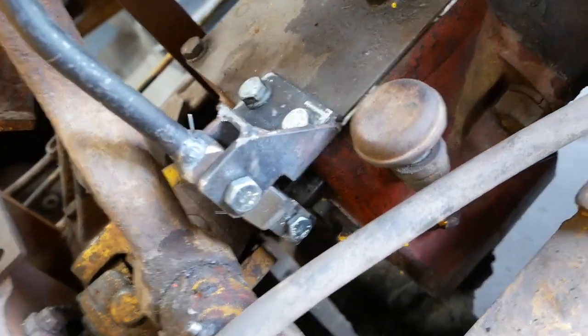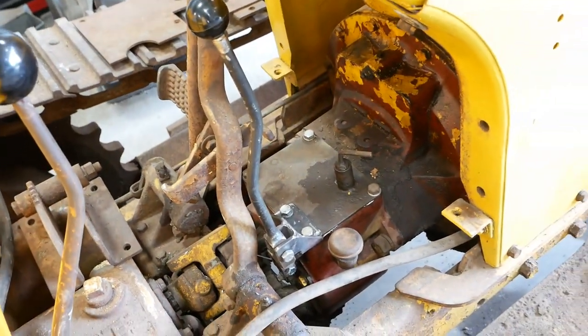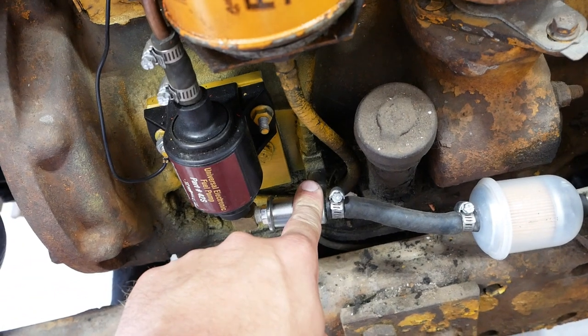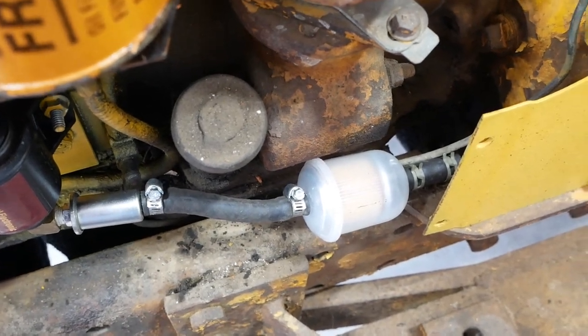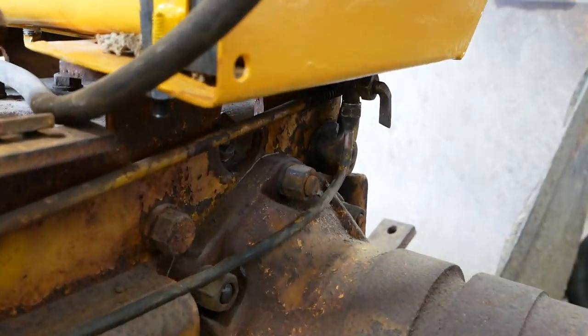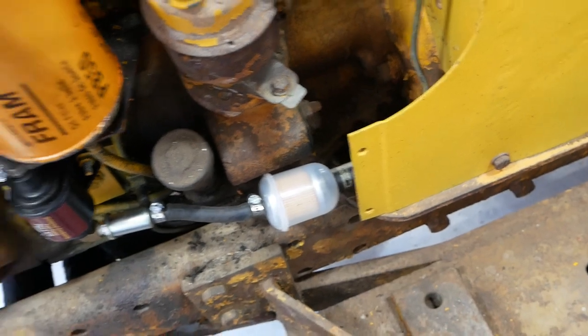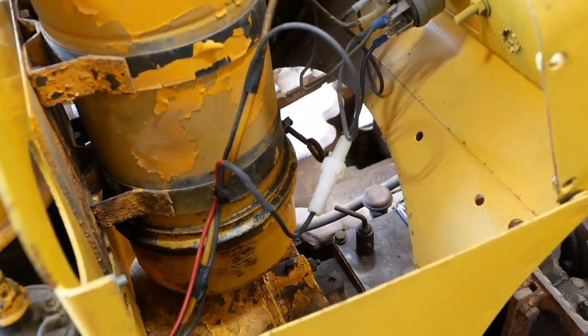So I fabbed up all these brackets and pins and all that jazz. It's good to go in my opinion. And you saw the pump I think before, and then it comes with this little strainer. I added an inline filter, again with just flexible hose. And then we go to a copper hard line that runs back underneath the tank, and there's also a shutoff valve there. So I think that'll work just fine. There should be a side panel here that'll protect this filter, keep that from getting damaged. Yeah, it's wired in with the key switch. Got an inline fuse holder there. I guess